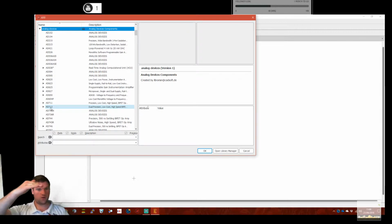When you charge one, you could get one charged up to 5 volts and the other one at 0, which would actually overcharge them. Because this is 2 caps in series, each rated at 2.5 volts. In fact, I can see on them 2.7. So in theory, you could push this to 5.4 volts.